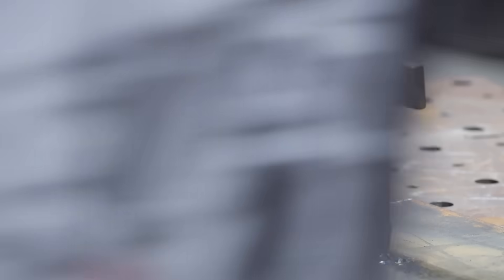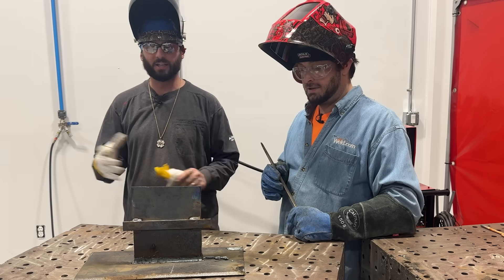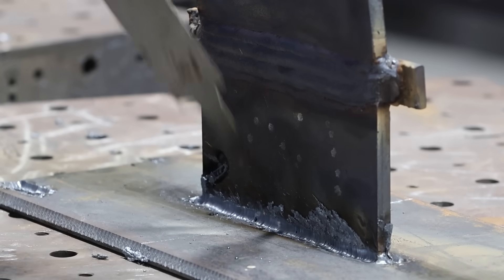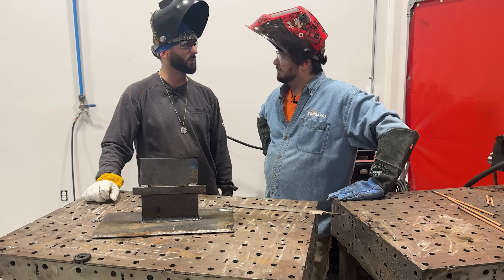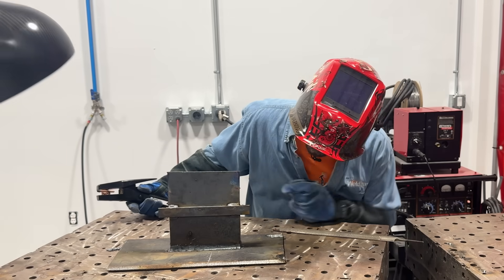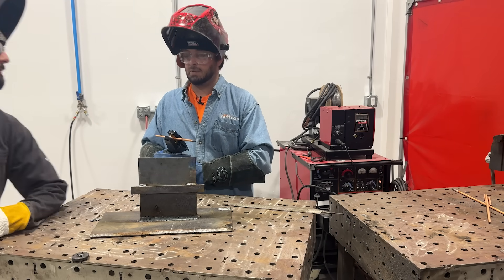What did you think of that? You did good! It was very fun and quick and easy. I do think I went too deep though. It's satisfying, isn't it? It's so easy to remove metal — so fun. All that material just comes off easily. If you have the air set up properly, all that dross should be able to be removed easily. We're going to gouge off the rest of this, then be a little more careful on this backing strap. Just rip at it — you can see I went really deep back here. Work a little deeper on your side and look for that fine line where that plate meets this plate.